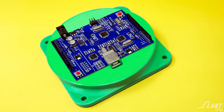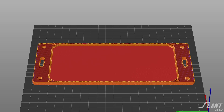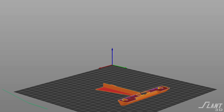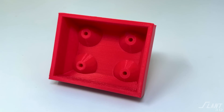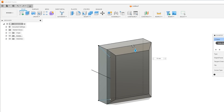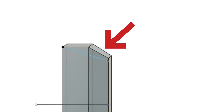If you're designing an electrical enclosure to be manufactured with 3D printing, the first thing you want to do is make sure that you can print it on an edge, not flat down on a build plate. That really restricts volume and increases the cost of the part. Instead, put it up at a little angle, add a rib underneath it, and print like that. That creates a more uniform surface finish, better strength, and makes it more producible overall. All you have to do is add a chamfer to the outer edge so that there's a flat surface for it to balance on.